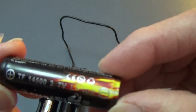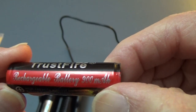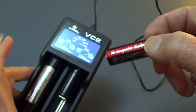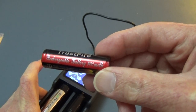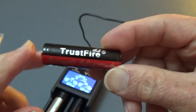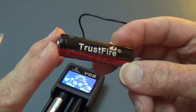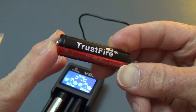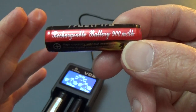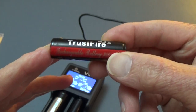It went up to 4.2, and the total number of mAh put into this battery was 734. Right here you can see this battery is supposed to hold 900mAh — see the capacity right there? Well, according to this charger, starting from exactly 3 volts, the charger put 734mAh into the battery, not 900. So what this charger will do is tell you, if your battery is completely depleted, exactly how much mAh can be fed into it. This particular battery's 900mAh rating probably isn't correct, because the charger only put in 734. That's a handy feature so you know how good your batteries are.